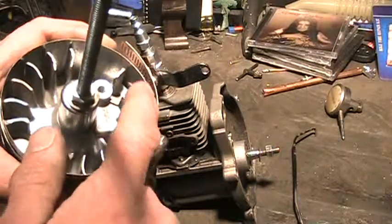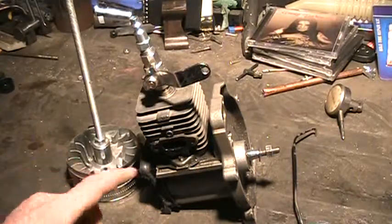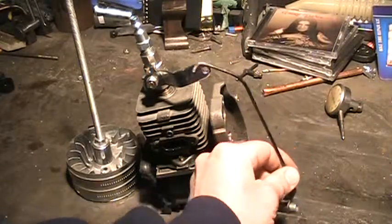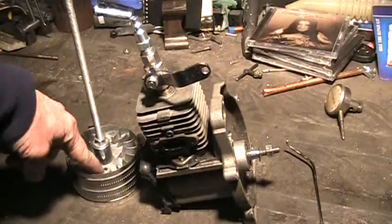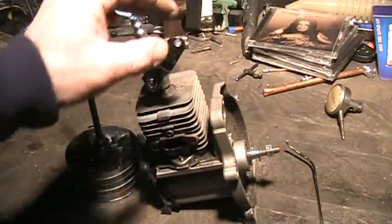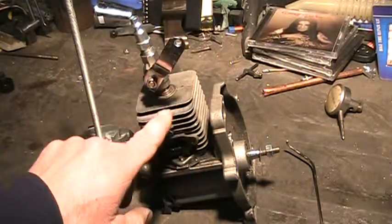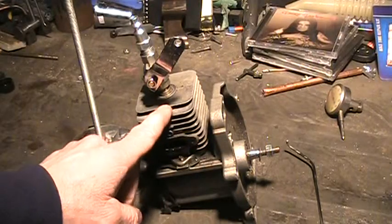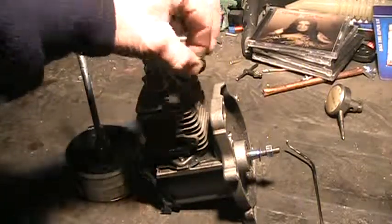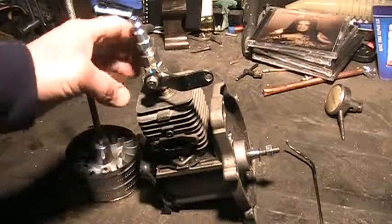The finished flywheel will be nice and smooth with radiused corners so it's quite safe. The flywheel has an arm attached, screwed into holes here, so when the flywheel comes around it pushes up on this arm. The arm is timed to open when the piston hits top dead center, which lets in the steam, pushes the piston down, and the cycle continues — opening and closing the valve every time it hits top dead center.